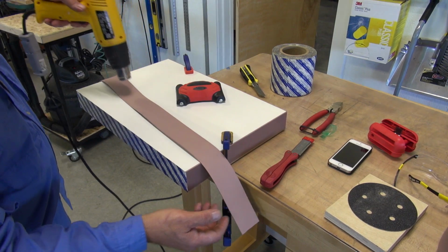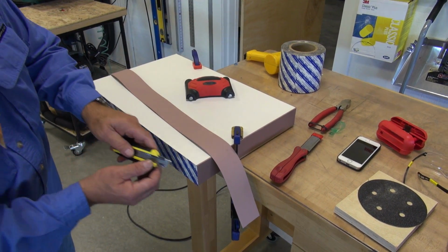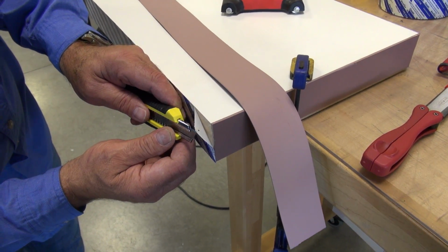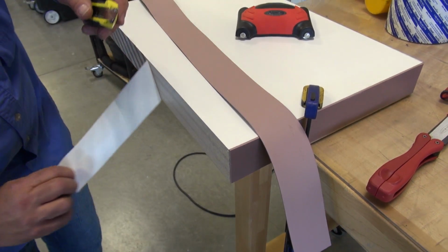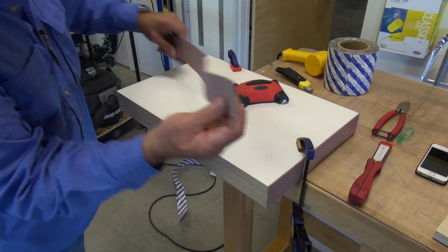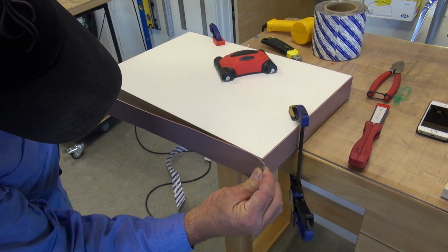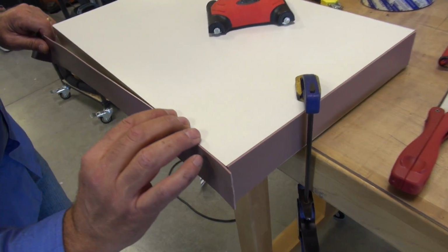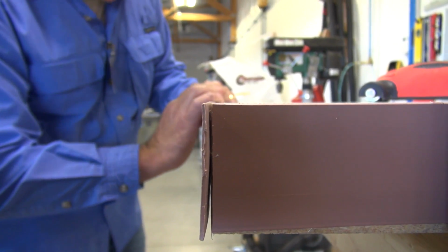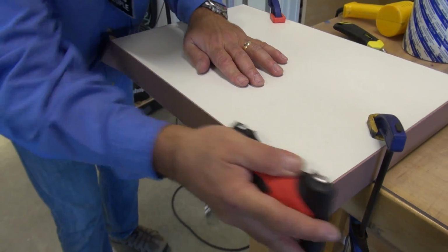And this is a pretty flexible 2 mil material as well. Then I'm going to take off the adhesive liner. And the little trick here is you stab in like that. And if you stab into the corner and pick it off, you can separate the liner very easily from the adhesive. See how I did that? Now, make sure I choose the right side. This is the finished side out. And I'm going to lay this on there a little bit proud, right? I'm laying it on there a little bit proud and pulling that over. So there's that. Now I'm going to go ahead and roll it.